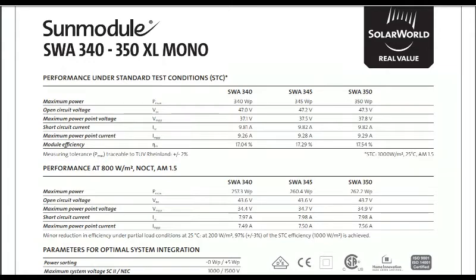There are some panels out there that go up to as high as 22%, but you're going to pay a premium for those panels. SunPower has the highest efficiency panel, but a 100-watt panel costs about $3 a watt. I would recommend when you're picking out a panel to try to get your panels at less than $1 a watt. This panel from Wholesale Solar is where I bought my panels in 2014, and I bought it for $270.